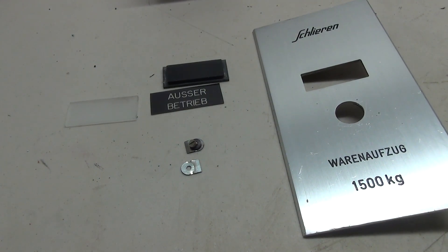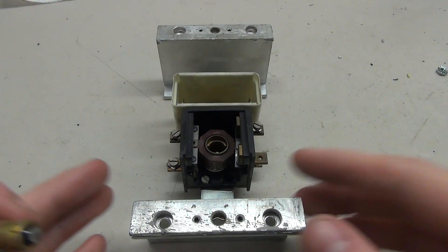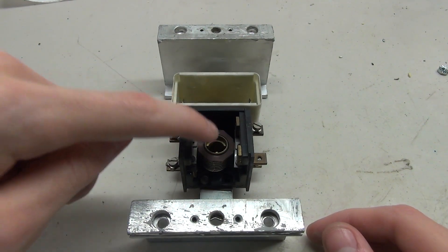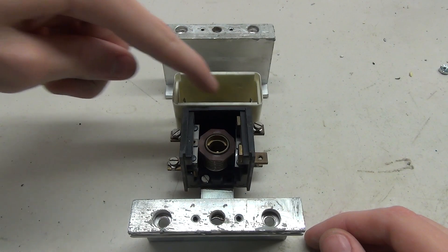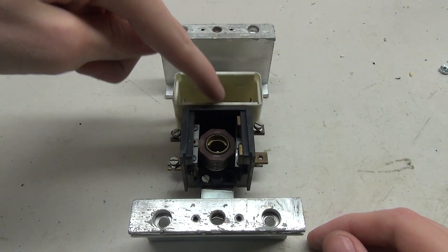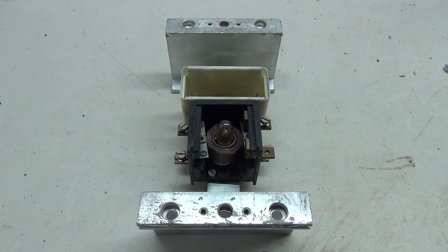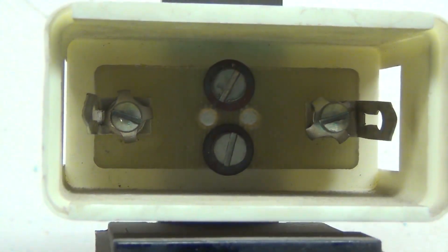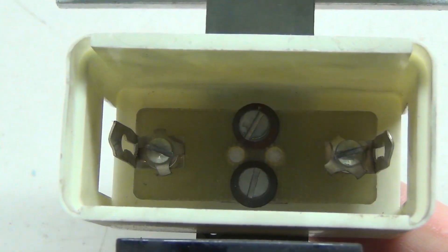The little text piece is back in there. Next we need to focus on the guts. We have two things to do: make it so when you press the button it lights up the bulb — the little light that says 'lift' — and also light up the text above, so we're going to put an LED or something in there. First we can add this GE47 bulb and twist it in place. Now with the little light bulb in place, let's work on the other part. We can use these little connectors to hook up an LED and see how it works.